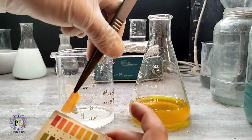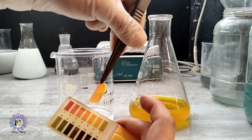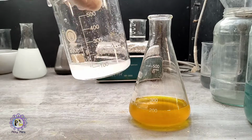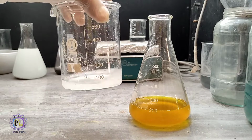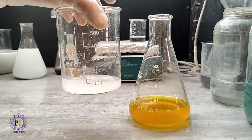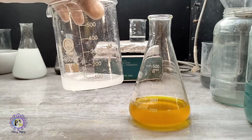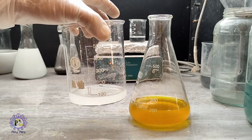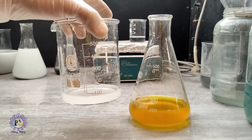It shows something around pH 4. That's right. By judging solution appearance, it is cloudy after addition of ammonium hydroxide. We don't need too much since we just need to adjust the pH, and the solution shouldn't smell of ammonia after stirring, so we don't need too much.